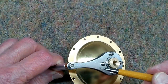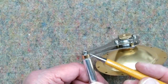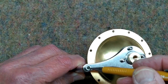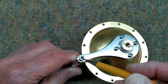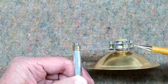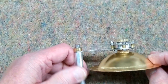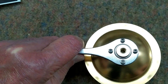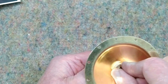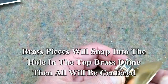All the rest of these are used to clamp the pieces together as a sandwich. I did find it was necessary to leave these a little bit loose until you got this installed, otherwise the alignment of that hole would be off. So I put that on tight, then snug these up. With those standoff spacers in there, I put this in. When I put this together, it was spinning pretty crooked, so you have to gently fiddle around until you get those o-rings and everything to nest in the hole that's stamped in this.